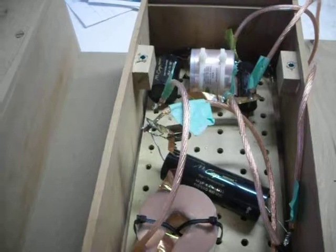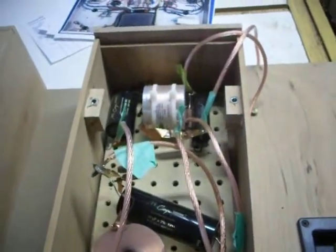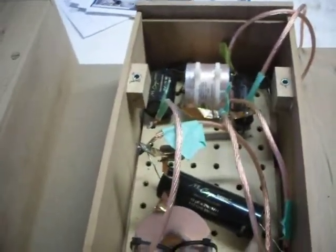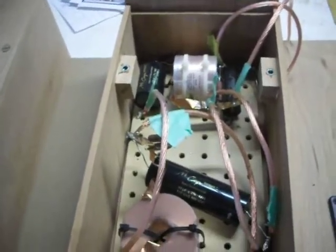Went ahead from Parts Express and went with the Dayton Audio 10 gauge speaker wire. It's an over 400 count oxygen-free strands in each run, they should be fairly good. The only problem you have to watch out for is when you're trying to solder this stuff. I basically used a butane torch. It's really about the only way you can do it. I don't know if that's actually soldering anymore or where brazing begins, but that's the only way you can do it.